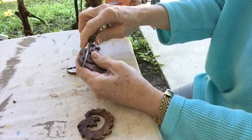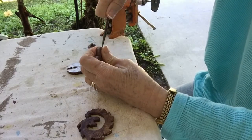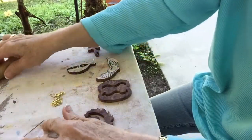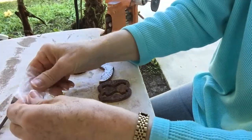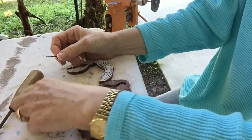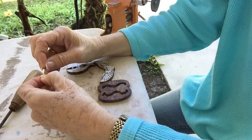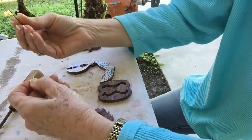There's one side, and there's the other side. These are the little eye hooks — they actually have screws on them. I don't like the idea of just drilling a hole and gluing something in; I like my work to actually be engineered. And I have a bit that is just the right size. The way you know it's the right size: you have the thread and you have the shank, so you pay attention to the shank. You lay it over top of this screw, and when you cover it up, the only thing you should see sticking out is a little bit of the thread. That's how you know you have the right size.